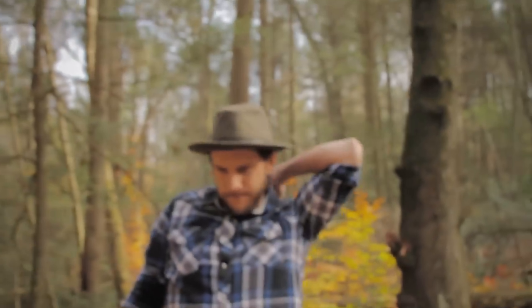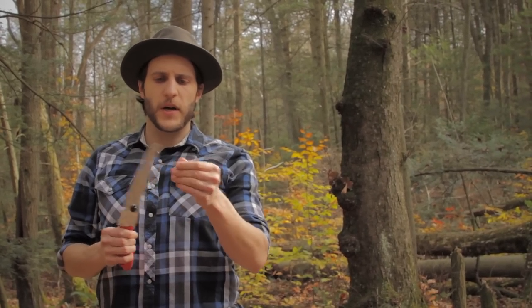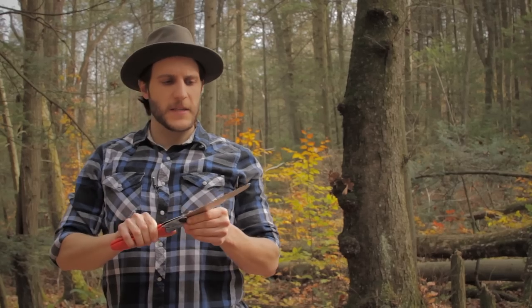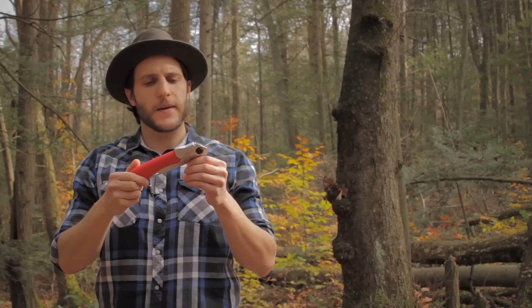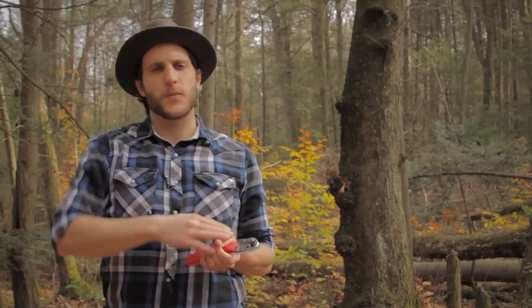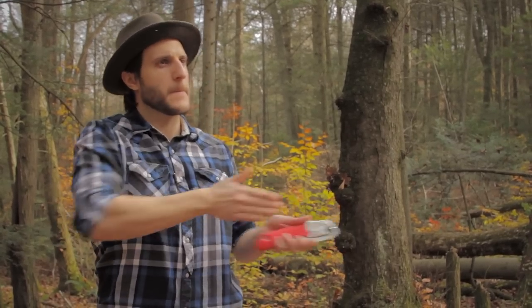That did pretty well. Like I said, these teeth aren't really meant for dry hardwood, but it did really well. And it definitely takes a little bit of different thought and technique when you're only cutting on the pull. This is Japanese made, and I've always been interested in trying out a Japanese pull saw. If you've seen hand carpentry, people use Japanese pull saws, which look a lot different, like this, but still just on the pull stroke, it's a lot different.